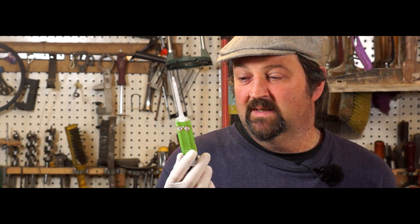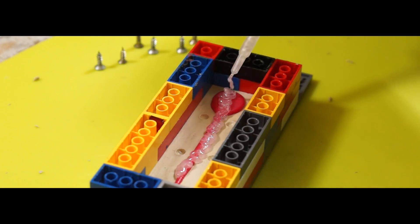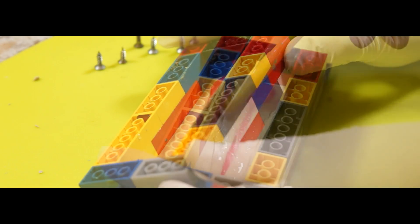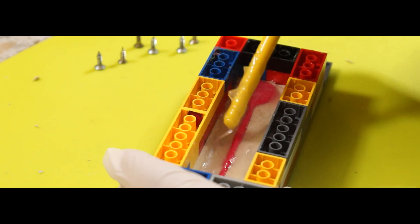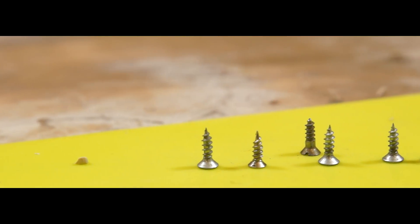The mold is prepped and ready to go. I've got one of these twin packs of rapid-set epoxy, picked up on offer at the local supermarket, which comes with a mixer nozzle so once it's pumped out it's pre-mixed and ready to go. I'm going to put down a thin layer of epoxy over the surface of the bait and the mold area — that should pick up all the detail and the glossy surface of the plastic. You don't get a lot of time with this stuff, about five minutes before it starts to turn to toffee, so I dumped on half the syringe and pushed the gunk around with the back of a paintbrush until I had a reasonably even but thin layer.